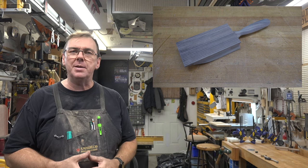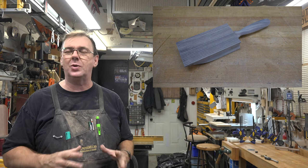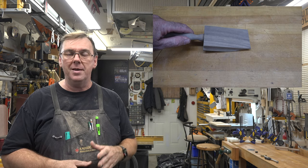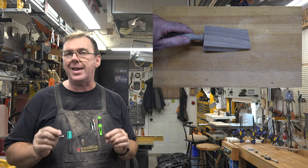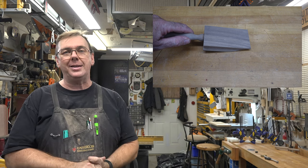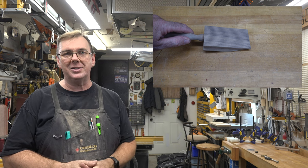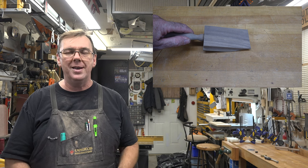It's very simple, but the key to success in this project, and I can't stress this enough, the key to success is careful measuring. Measuring out those 1/8 inch markings at the end of the gnocchi board to get your routings perfect, that is what makes this look like an impressive project. The rest is just kind of sanding and a little bit of lathe work.